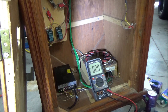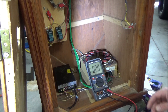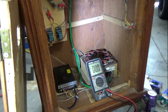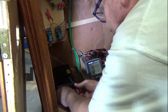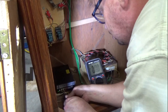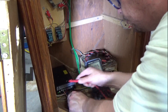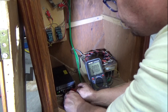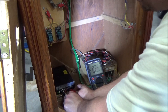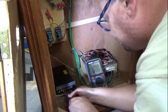5 volt is 2.5 volts — two and a half volts for five, which means there's a short somewhere taking half of it. Let me disconnect it from the circuitry in here — something's goofy. Let's take the five volt supply off and see if we get five volts there now. Getting 2.6 on unused common. From ground to five volts: 2.5. Across negative and positive five — that should be zero, not negative two and a half volts. Let's remove everything off of common.